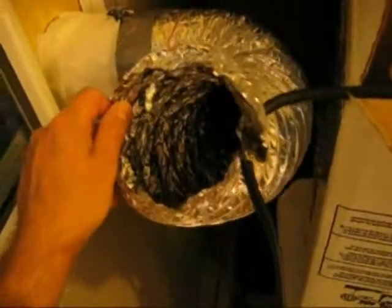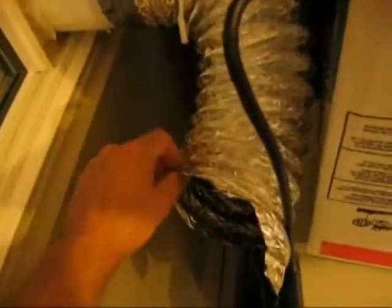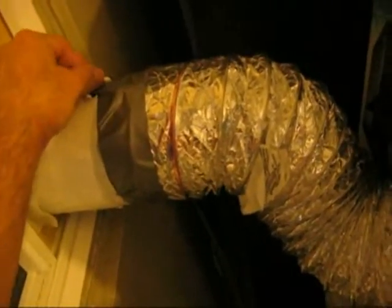I have this piece of foil ducting coming out. The pre-filter just gets rid of big fine dust. What I have here is a cardboard box with a hole cut inside it. And inside I have a HEPA filter attached to an inline fan — it's a fairly small one. And I cut a hole in the bottom of the box here. All I do is attach this thing to the hole like that, and I'll turn this little fan on. It'll actually pull air in because it's sealed.